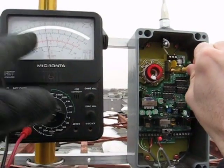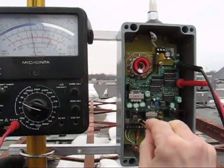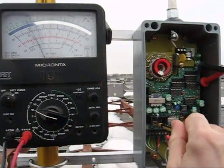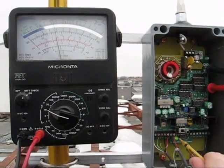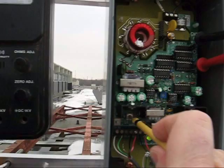It happens to be just about right there. You want to check it a few more times to confirm the peak. Now that you know you've got your peak, this little red light here will turn green when we're at 100 milliwatts — the legal limit. There we go, see the green light? And we know we have a good ground.